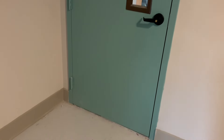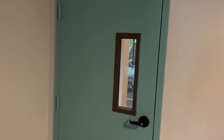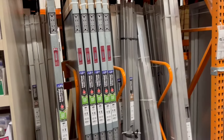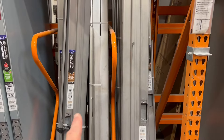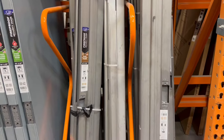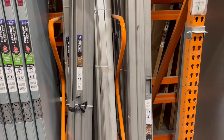Based on that information, you can go to the Home Depot or you can go to a door supplier that handles hollow metal commercial steel doors. Here's the commercial steel hollow metal door section at Home Depot. You've got the slabs in 32 and 36. You've got the knock down frames that can also be used as wrap around frames - they have those in 32 and 36 by 80. The frames come in 32 and 36 by 80.